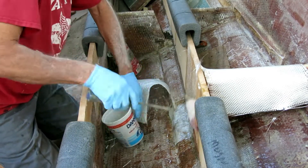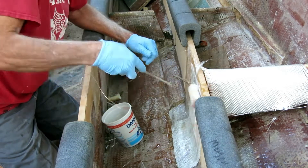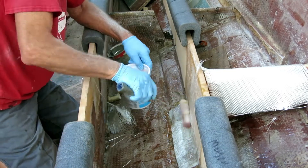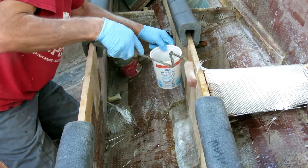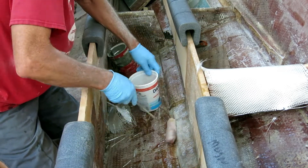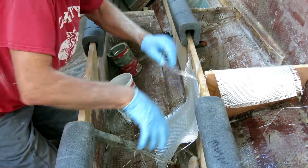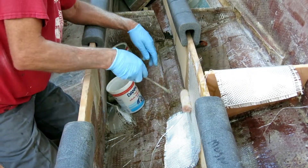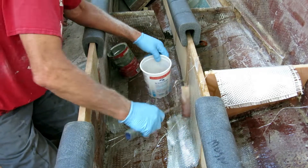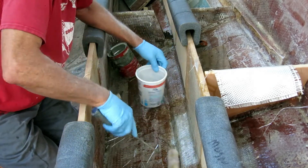In my world, I couldn't do this because I didn't have enough glass on hand — it's been ordered — and I don't want to wait; I'm a very impatient guy. So I started by glassing behind the intersections of the little bulkheads and the stringers, making sure I had some glass that ran through. This will be tied in later when I fully glass the stringers. It was a little extra trouble but I think well worth it — I think it adds strength to the boat.